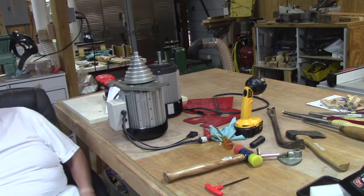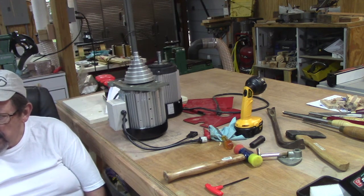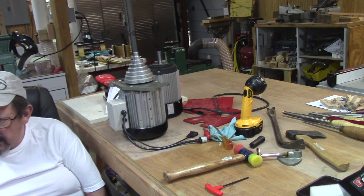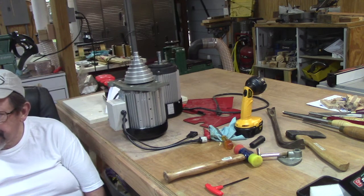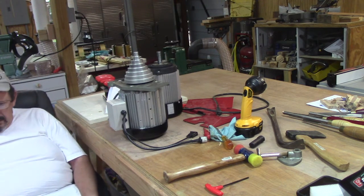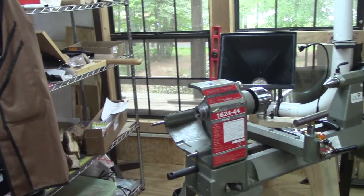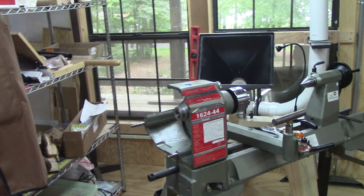So the procedure in the manual, basically, I'm going to put the motor back on, put the cam back on. Once the motor and the cam are back on, then before I tighten everything down, I'll put the red cover back on, the screws that go on it, hook the belt back up, and then I'll have to deal with the mounting of the rest of it. So I'll turn the camera around so we can record putting this back on. It's pretty straightforward. Shouldn't be much to it.